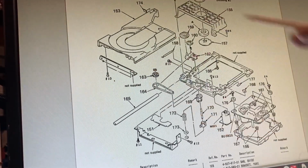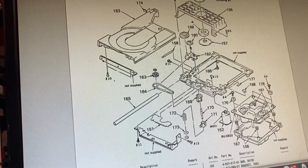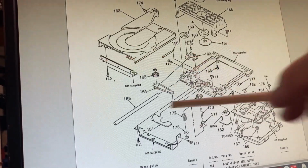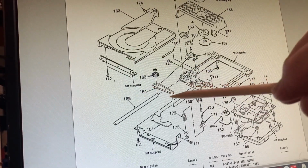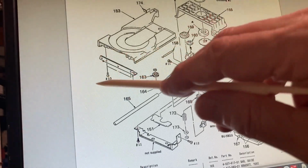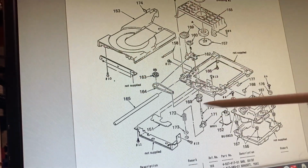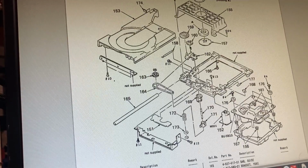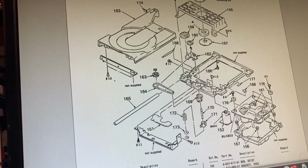After you then have this unit where it'll remove, and it'll come out, you move it backwards and then lift it up. You will have to take the CD tray cover off, and that's in place by just 2 Allen screws and comes right off. Then the whole unit will slide back and you just lift it up and then put it on a table somewhere.